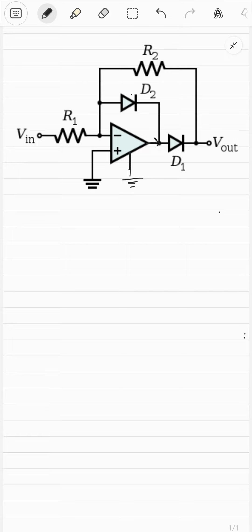The question was: why is this producing current when there's no current entering from the input wires? Of course it's producing current because it's drawing from the power rails, which are connected directly or indirectly to ground. The way I keep myself sane during calculations is by drawing a main ground wire, connecting the op-amp to it, and the output through a load resistance. Remember, there are no absolute voltages — only voltage differences, so V_in is a voltage difference between the ground wire and the input terminal.